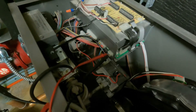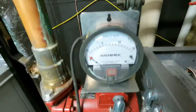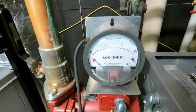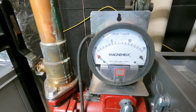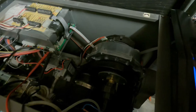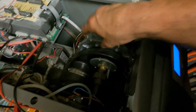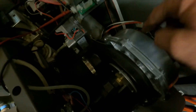I have to connect to the control board where my gas valve goes in, and then check my manometer. You can see I'm going negative pressure on my manometer — watch that first. We hear the spark going on, but it has not moved — I have zero gas going through. I'm reading negative pressure because this is a blower, not an inducer, so it's blowing the gas into the heat exchanger.